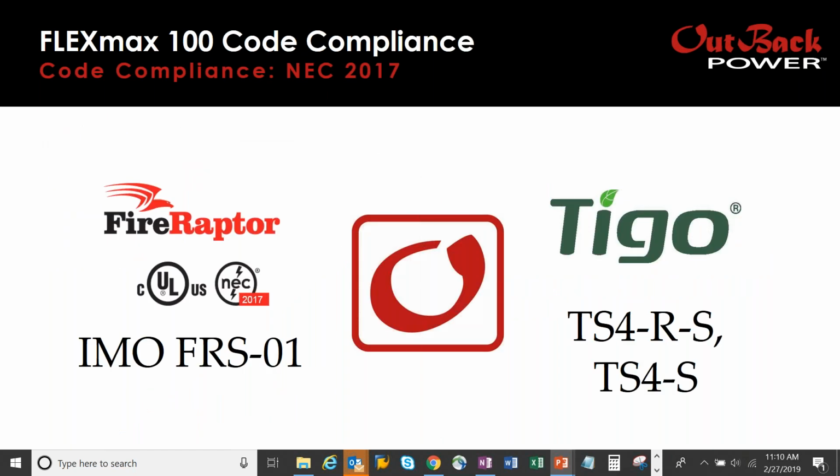Now, this is in regards to module level rapid shutdown, and I'm sure many of you will have questions about module level rapid shutdown. It's a hot topic right now, and we will make sure to address it at the end. I want to get through the presentation. For those of you who have to leave early and maybe will view the recording later, the FireRaptor IMO FRS-01 is tested and approved with the FM100, as is Tigo's TS4-R-S and TS4-S.